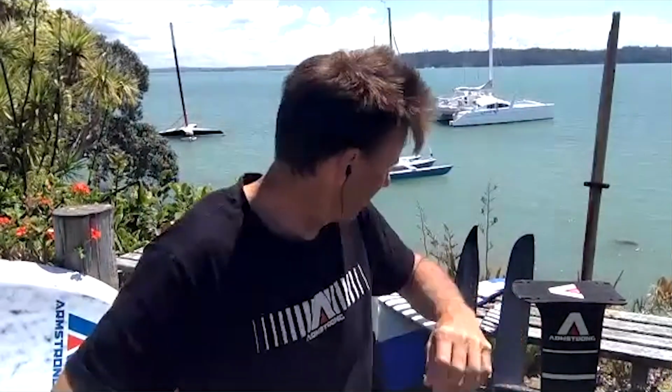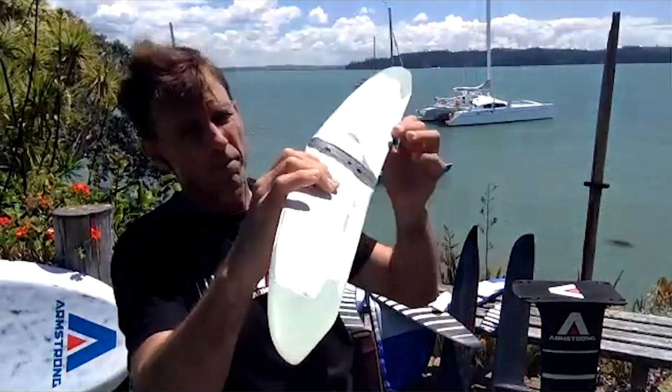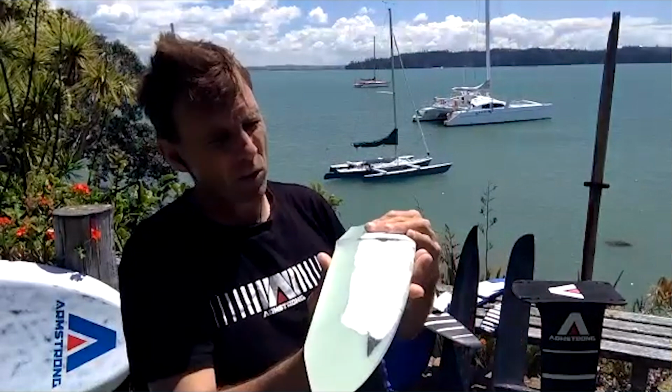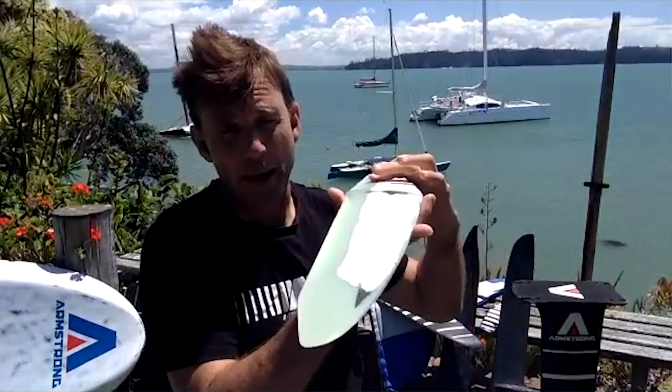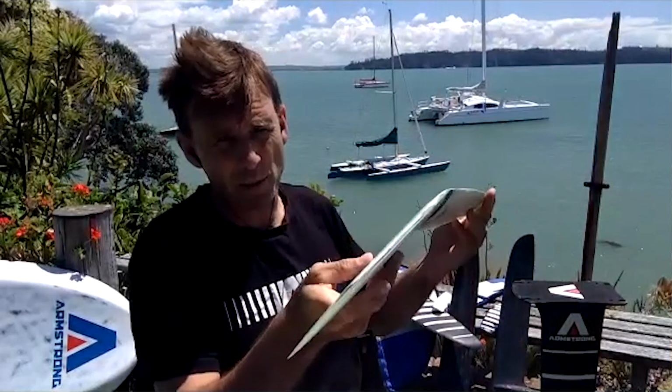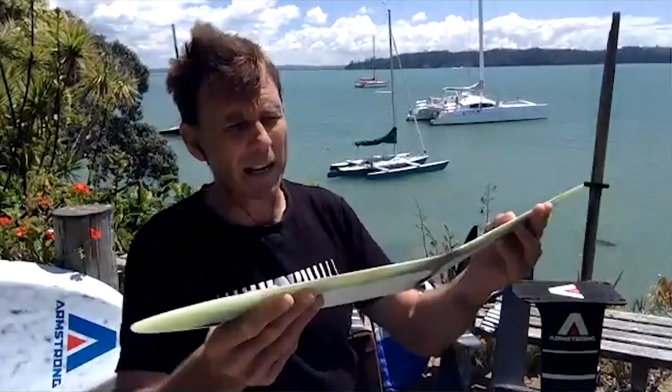Right. There are definitely some high-aspect foils out there, and they do give you lower drag, but they're harder to turn and generally harder to ride. I made some high-aspect foils like this. Here's a G10 foil. I made this thing maybe in 2016. It's CNC G10, very similar to what KD on Maui is doing right now with his prototypes. It's a great way to prototype foils: CNC some G10, super heavy, but you can try stuff.